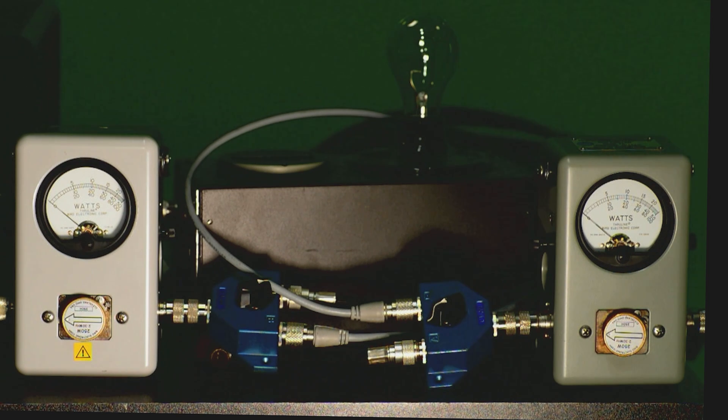This is W6LG. On the tall table next to me I've set up a test stand with two lengths of coax — one RG8X, the other 400 Max from DX Engineering. Both Bird watt meters have 250-watt slugs. I've calibrated them so they read the same. The Bird on the right gets the power; the switch determines which cable is being used, either the 8X or the 400 Max. The meter on the left is the output meter — that's the most important one.